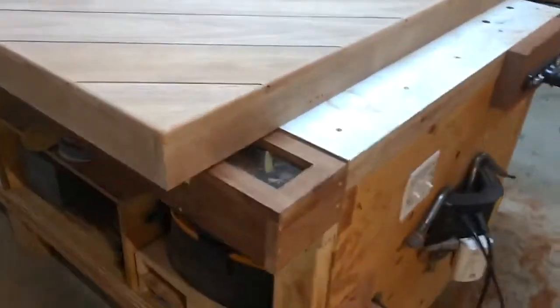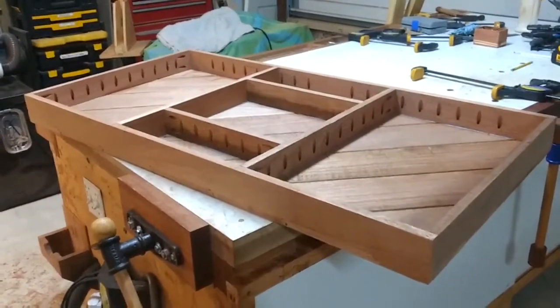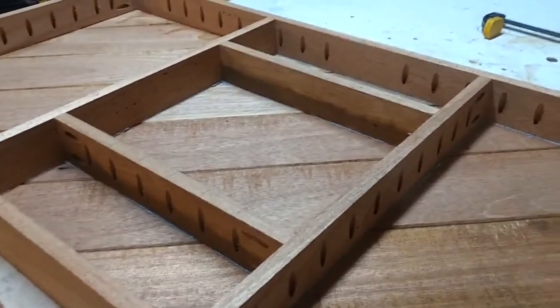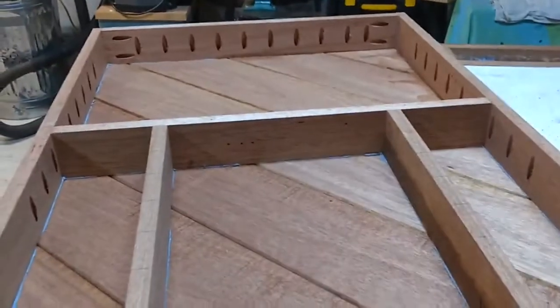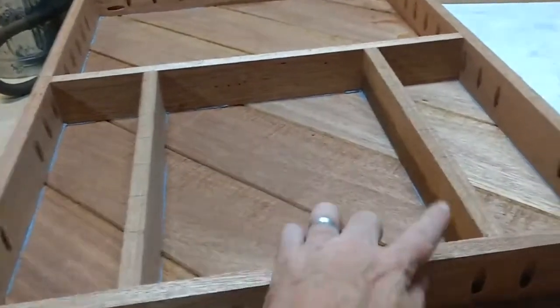I just finished taking the router and a round-over bit to both boards. They came out looking probably too good to be cornhole boards, but they really are just crappy reclaimed mahogany. Looking at the underside, I put a lot of reinforcing in here — it's not 100% necessary, but I did want to incorporate a built-in storage location for the cornhole bags. The bottom of the other board looks exactly like this one, so when stored they'll be folded on top of each other and create an enclosure.